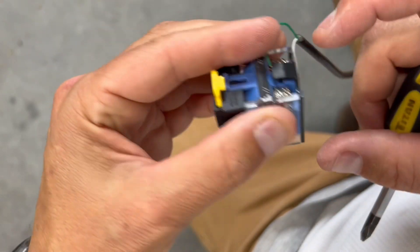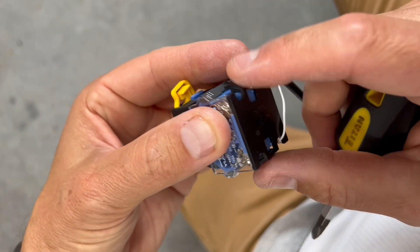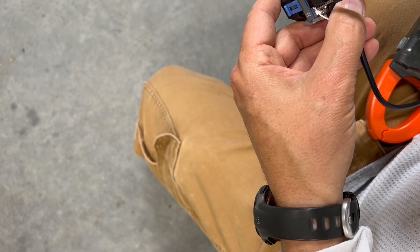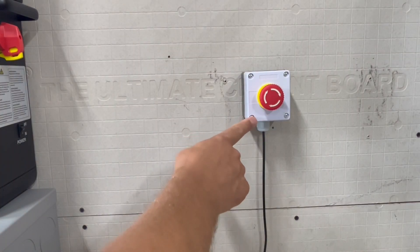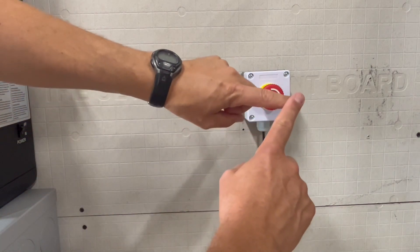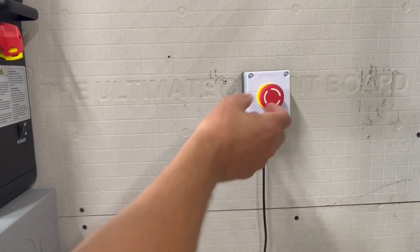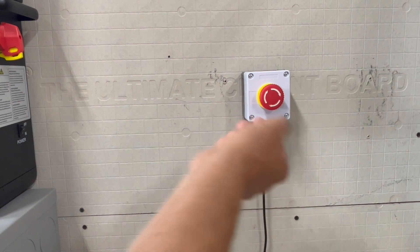While wiring it up I noticed numbers on the terminals — 11 and 12. Like a PV disconnect, these two probably wire together and then these two. This switch actually had four different terminals; I think a lot of them just have two. I can verify by checking continuity — and yes, these two go together. But this switch turned out to be a problem: it's normally closed with no option for normally open, meaning to trip the relay you actually have to turn it to what would be the neutral or 'on' position, which is the opposite of what you want.